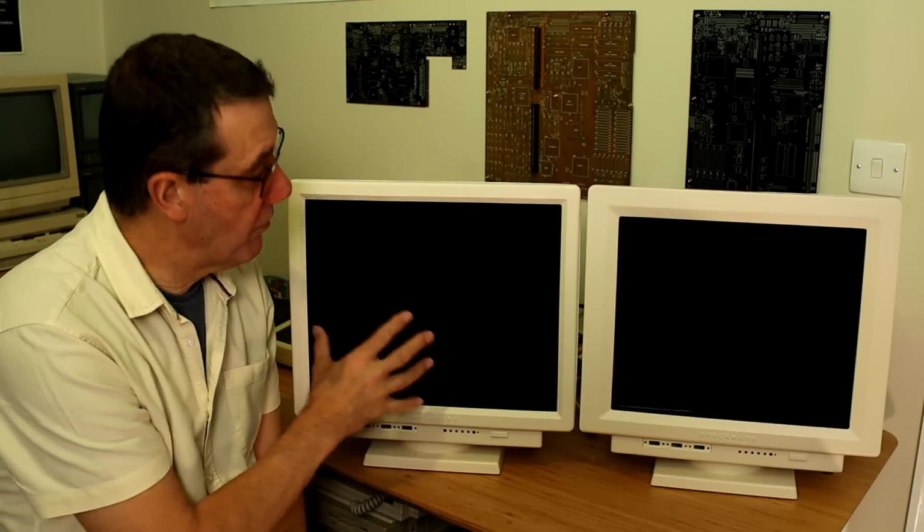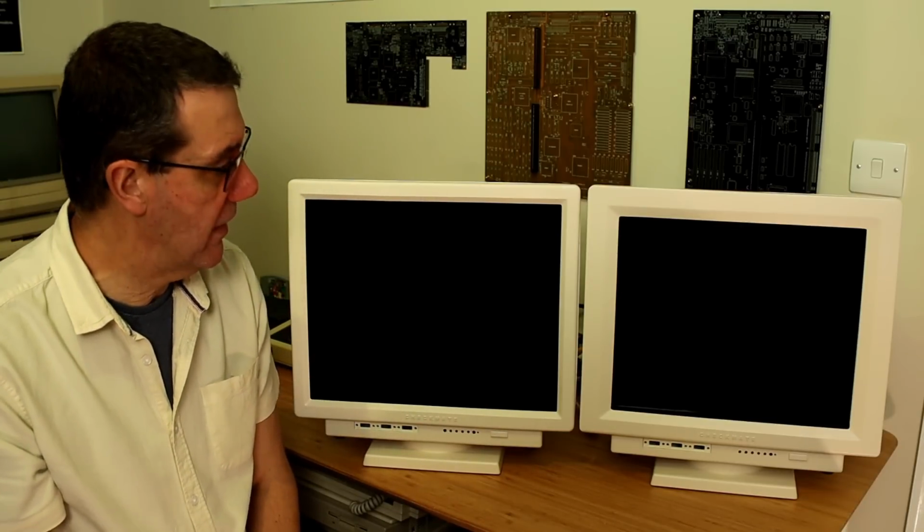For reference, they both have 1280 by 1024 display. Hence the comment people saying 5:4 instead of 4:3. I wouldn't put an actual 4:3 panel in here because this size is really, really nice for the whole range of uses of this product, plus the fact you can get them in good numbers. They're not rare like lots of these other panels, but you can't get them, quality's not very good. Whereas these are industrial grade. Now I suppose I'm going to speak a little bit about the panels.